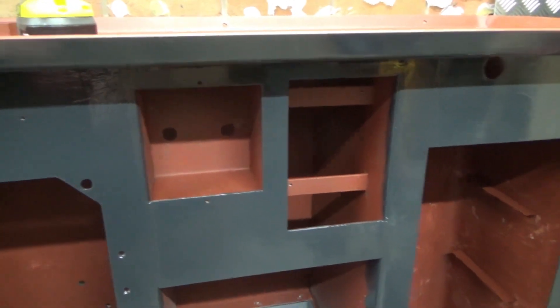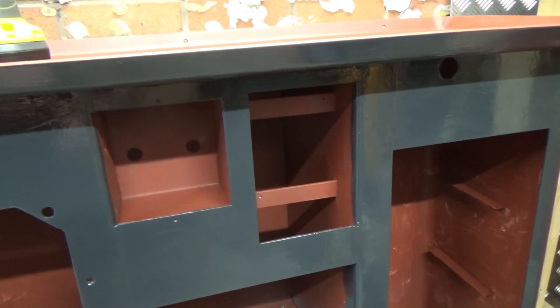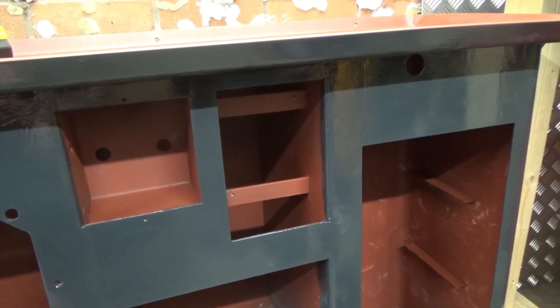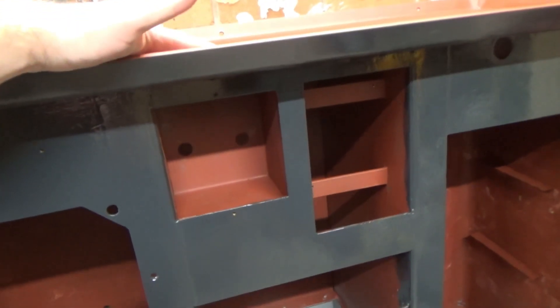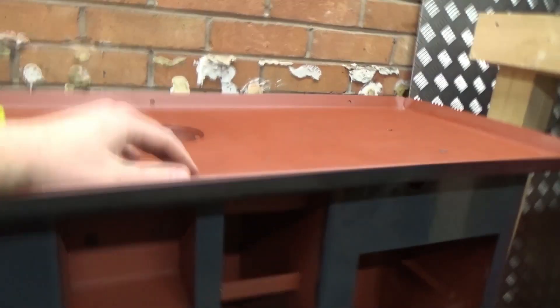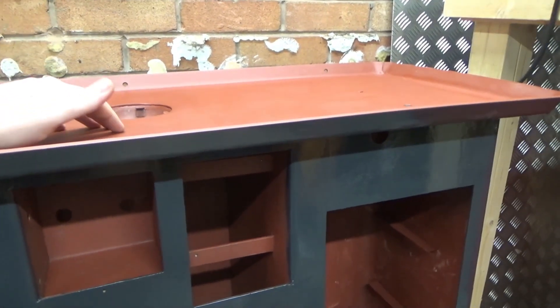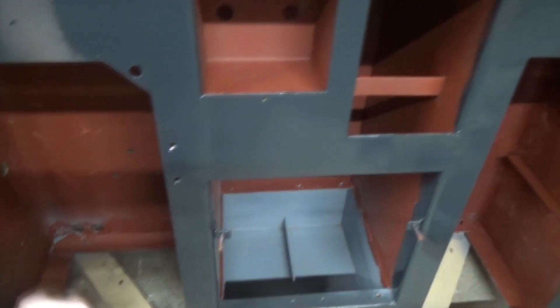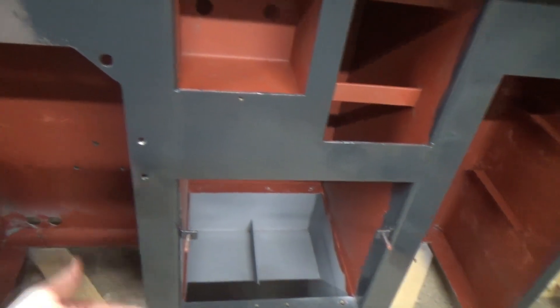I made the best of a bad situation. The rest of the parts, because they're small, I'm going to see if I can thin the paint down a little bit and put it in the spray gun and spray them. It doesn't really matter too much about the stand anyway. The stand's in - I've got the stand on two pieces of wood just screwed in, so once I'd painted, this was actually upside down in the garden. I just wanted to get it ground before I brought it back in and put the red oxide primer on there just to stop it from rusting in case it was out there longer than I thought. Put it on these two pieces of wood so as I'm moving it about in the garden and dragging it through, I'm not damaging the underside, because I don't want that to rust either.